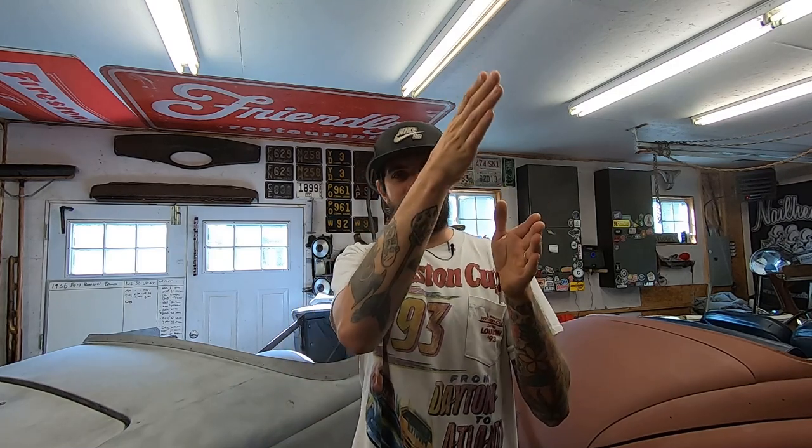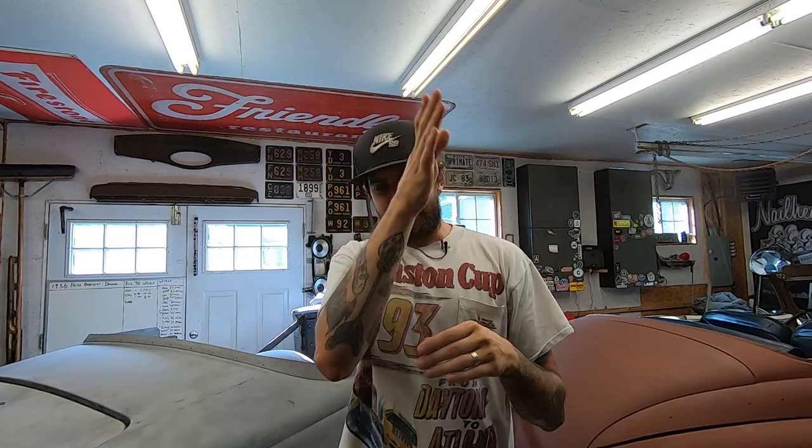And he wanted rear fender flares on it. Oh, maybe fronts too. And the rears, instead of shaping a piece that was a fender flare, he wanted a more boxy kind of flare. And we bent strips. I think this was my idea. We bent strips of what we wanted, like the body come down and then the fender flare come out and down. We made that shape in little strips and then literally welded. It had to have been 100 strips together to make that fender flare.